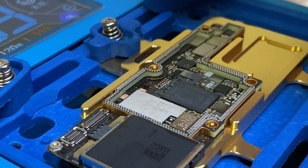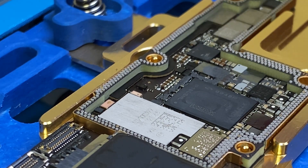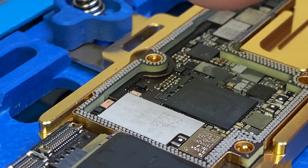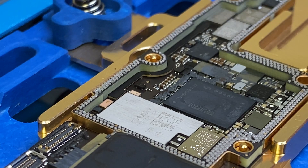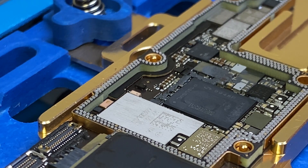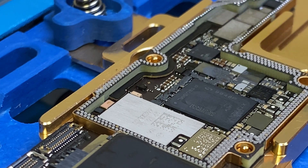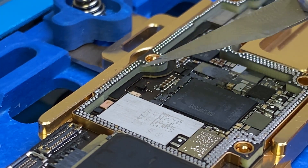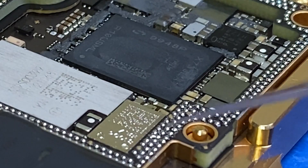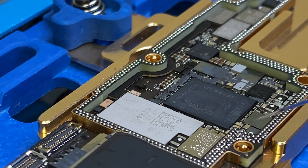Now back to the repair — let's watch them heat up and melt here in the next ten seconds or so. We should see the solder start to melt, and there's the beep saying we're at temperature. The heat needs to transfer all the way through up into the top of the board and we'll see it start to melt. And there we go — it's already starting, so I'm just going to turn the machine off. The residual heat will make them all melt. It looks like I've got a little bit of bridging right here that I've got to go address, but otherwise we are good.